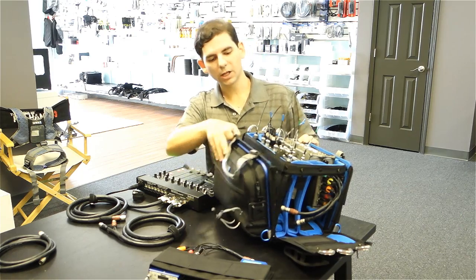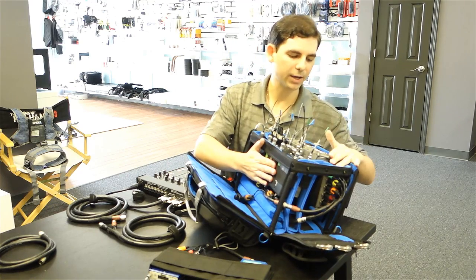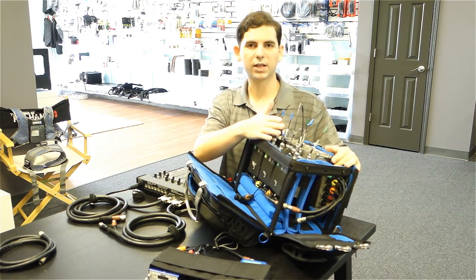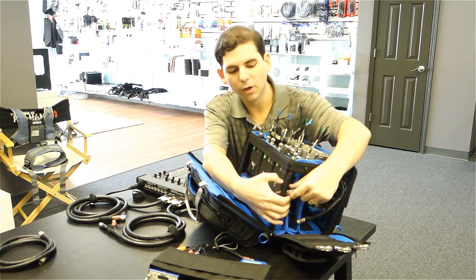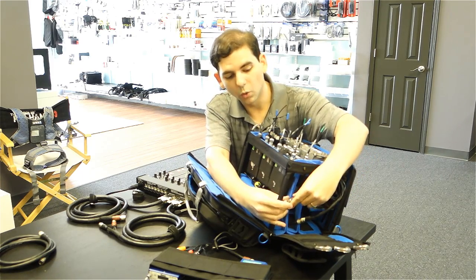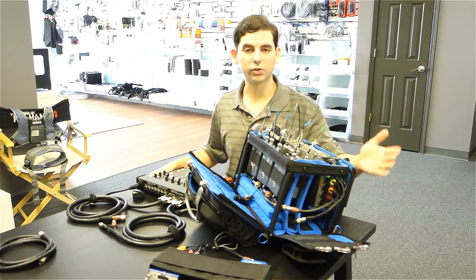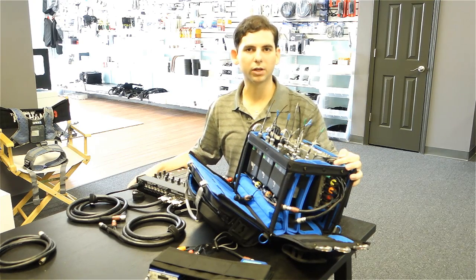This system is developed so that you've got a head that goes to your wireless receivers and a tail of the cable system that goes to recorders. There are four channels on each Hydra cable, so if you use two heads then each one can connect four receivers, and then you use two tails to connect the eight channels to your 788. You then have just two locking connections in the middle to plug it all together — one connection, two connections, and your whole bag is wired. It makes it real easy if you need to use the same wireless systems and switch recorders; you just use a different set of tails for whatever recorders you have. We make heads and tails to match just about every product out there.